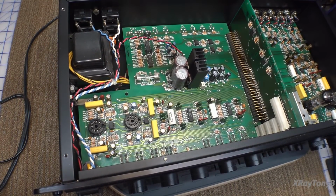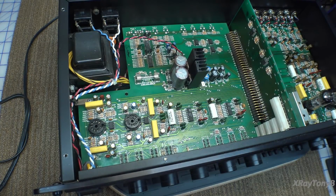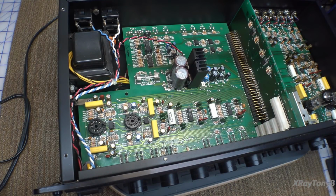Now I'm taking the microphone off again. And you hear those little pops? And they're randomly between the right and left channel. So here's left channel, right channel, and again, we still have no tubes in there. Now, obviously this is an open circuit, but you could see just moving my finger, super duper sensitive. It's like something in here, like we're losing a ground or something somewhere in here on the circuit board. Very strange, and it seems to do it intermittently.